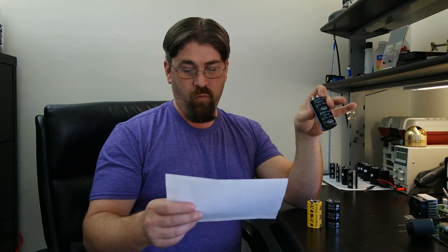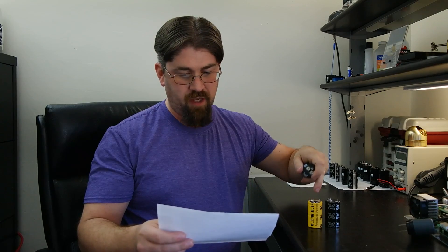The screw-terminal one, though — after just 24 hours it was already down to 1.51 volts. At 48 hours, 1.24 volts. At 72 hours, 1.07 volts. This thing only had about 1 volt left after three days, whereas the other two had 2.26 and 2.33 volts respectively.